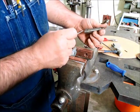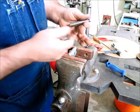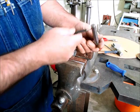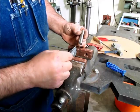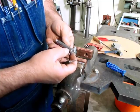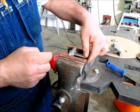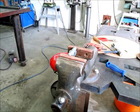So that's unfortunate, but the hole here, it looks like it was just drilled kind of randomly through the part. It's not in the center. Yeah, it's off center, which always makes it a pain in the ass to pick up again. But maybe what we'll do in this case is make this a press fit in the new part here. Scribe in a minute.